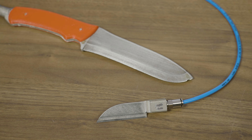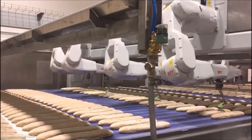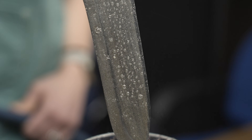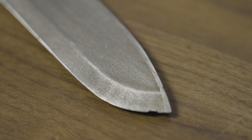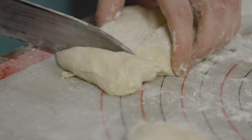Let's wrap this up. This is a 3D printed knife used to cut sticky bread dough by a robot. It's made through laser powder bed fusion and made to be deliberately porous. Part of what's so cool about this application is that the porosity is not designed in the CAD model — it is engineered through the 3D printing parameters, actually created in the 3D printing process. Using compressed air pumped through the pores in the blade allows these knives to cut through sticky things like bread dough without any sticking. And before anyone asks — yes, you can put it in the dishwasher, and you can also heat treat it in an industrial setting to clean it.